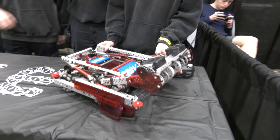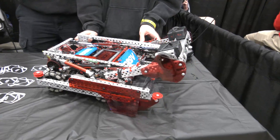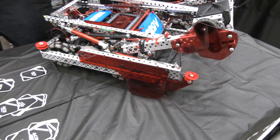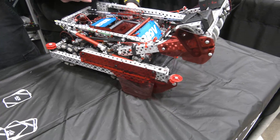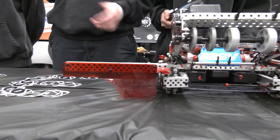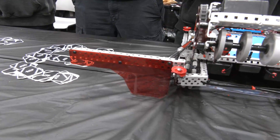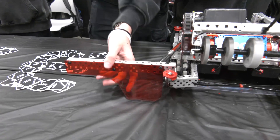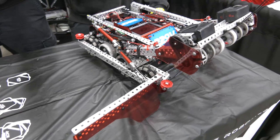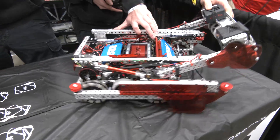Passing it over to Logan, who'll talk about some of the other features — the wings and the H-tier hang. The wings are pretty simple: one piston on each side, with angled wings on the bottom. This helps with both skills and in-match autonomouses, so we can push over every triball we want with this little angled piece, which we bent by heating it with a torch. We also cut out a little section so we can remove triballs from the corner during match autos and in driver skills — we go against the corner and sweep the balls out really efficiently.